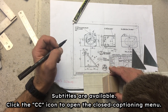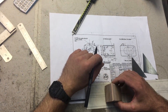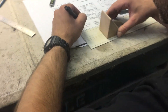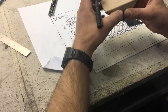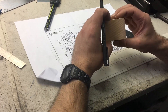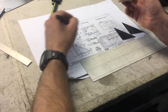Due to the busy workshop and spontaneous nature of the filming, you may need to listen closely to what Chris has to say. "So I'm making a wooden mould basically — so you can bend the metal and make sure the bends are in the right place. You've got some stiffener tabs on the top and the bottom, so you'll obviously radius the wood. Some nice hard maple. That will basically create the shape and make sure the dimensions are right, because this is basically all the inner dimensions of this."